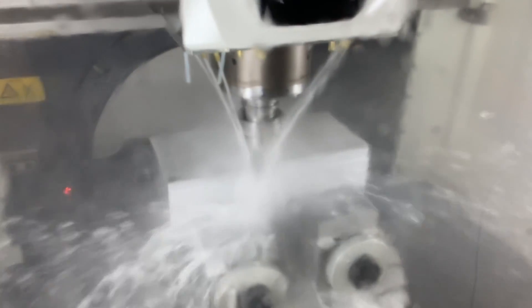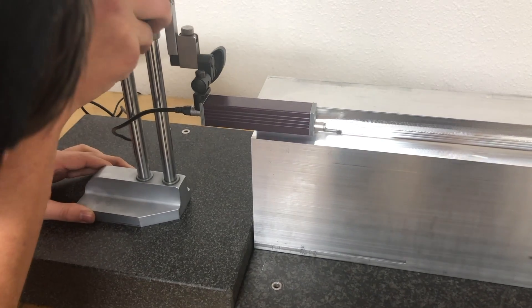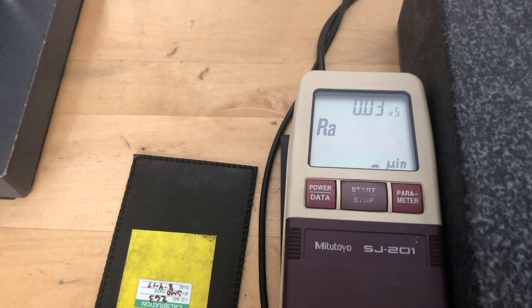This is an opportunity to put out questions, talk to us, and have a conversation — manufacturing and machining are amazing. A lot of people look at the Core Five and think it's just five flutes, cooling through, chip splitters — but many don't understand it can rough and finish. During testing, we were an inch deep, 100 thousandths in, going from 400 to 500 to 1000 to 1600 inches per minute, cut after cut. We even dropped to 145 inches per minute at 100 thousandths, one inch deep, and the surface finish came out at Ra 5.9 — that is insane. Go to the description below and register for this event.